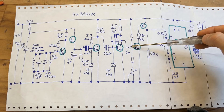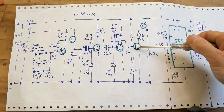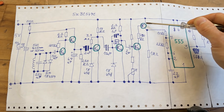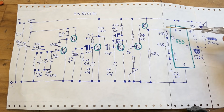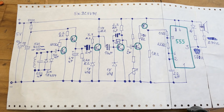Then it goes into the next stage with this transistor and a potentiometer to set the voltage on its base, set such that the base voltage is just below the threshold where this transistor starts conducting. Coupled directly with no capacitor into the last amplifier stage, this goes into the voltage-controlled oscillator — a very simple 555 oscillator with a speaker or piezo buzzer. Instead of connecting the resistor to the positive rail, it goes to this transistor, which modulates the frequency. The more current goes into the circuit, the faster it oscillates — basically a constant on-time but variable off-time.